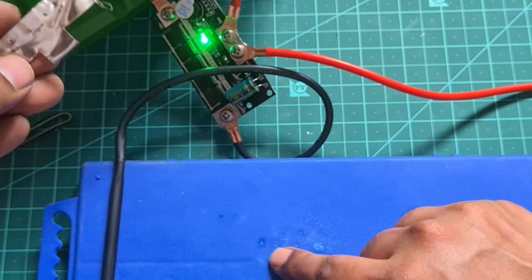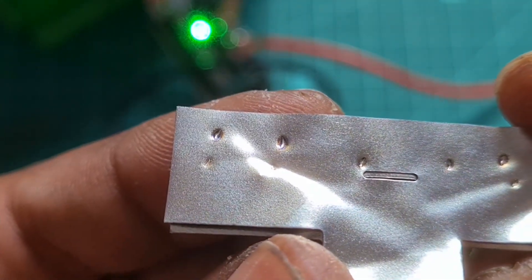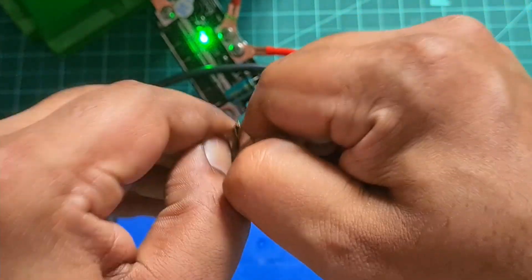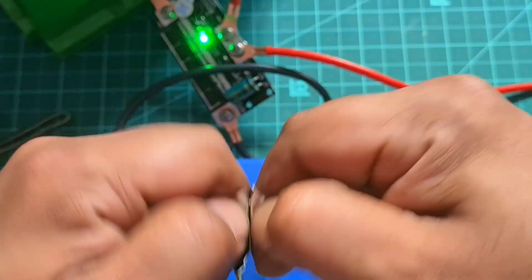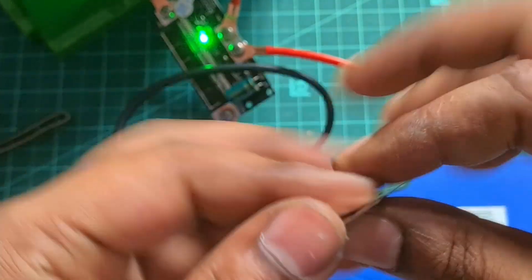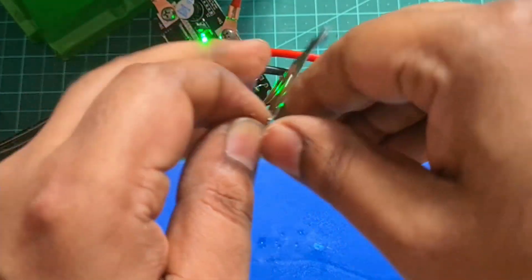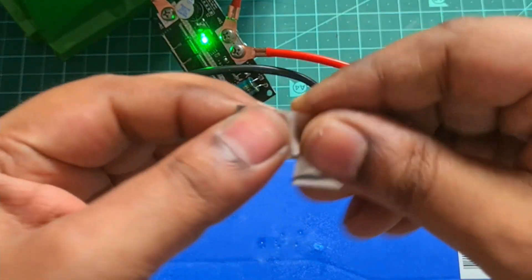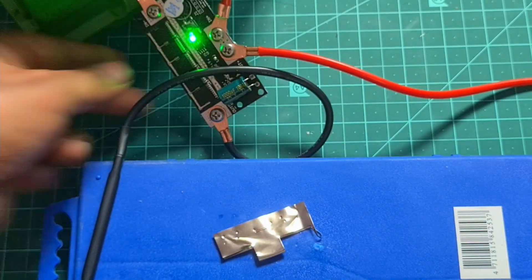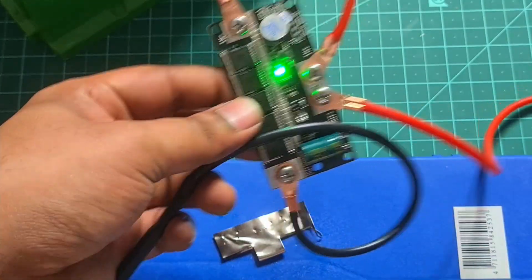Level five is quite strong — it actually melted the plastic at the end. I wasn't able to rip off the nickel strip with my bare hands; you'd need pliers to rip out the nickel strip itself. This sort of power is more than sufficient from a 1400 rupee spot welder. For hobbies, home use, or building a DIY battery pack up to around 30–35 amp draw, it should work perfectly with some gaps in between welds. I'm really satisfied — I wasn't expecting this level of power.